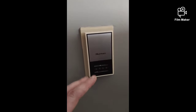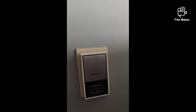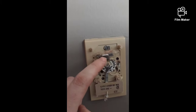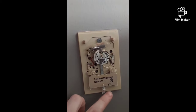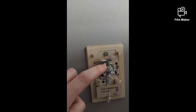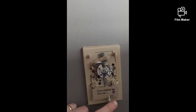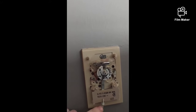This is the kind of thermostat most folks are familiar with in older homes. You've got the little lever on the bottom that you set to what you want the temperature to be. Inside, you can see a little bubble of liquid mercury — basically what's inside an old-school thermometer. As you move the lever to hotter temperatures, this coil expands with the heat, moving the mercury to cut off the heat. When things cool back down, the mercury moves back over and the heat turns on again.